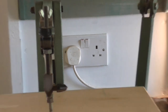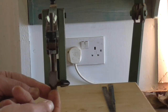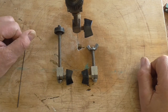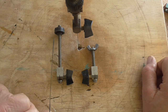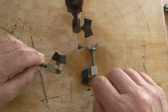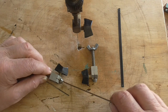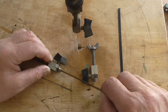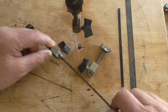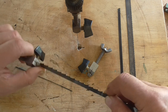This particular saw has some unique features. The blade holders I've got in at the moment are especially for fretwork blades — they've just got a tapered hole so you can insert the blade easily without even looking at it. There are also standard universal blade holders that come with the Diamond saw. They're universal and will take any type of blade — a normal fret saw blade, or even a metal hacksaw blade using the pin and hook method. You can even use a 10-inch hacksaw blade by adjusting the thread to increase the distance between the two blade holders. You could even use a piece of broken bandsaw blade, though that seems quite dangerous with a sharp blade whizzing around.